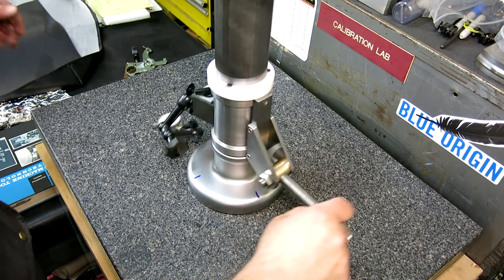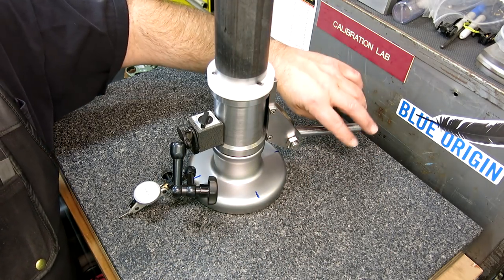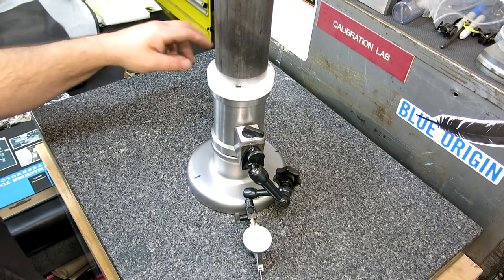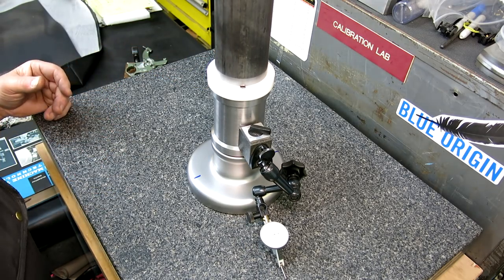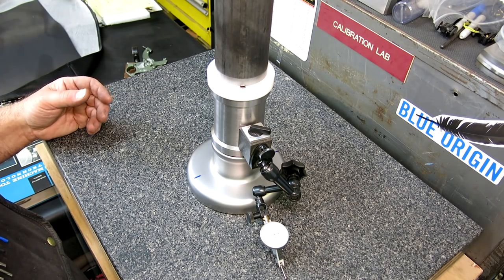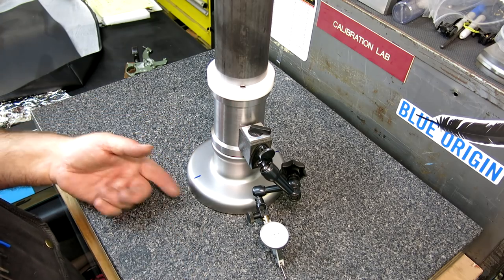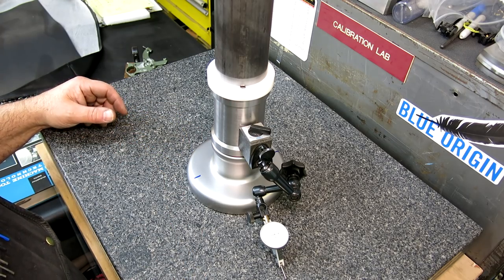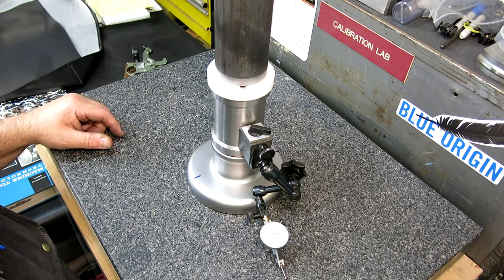1 1/4 thou. And half. Okay, so this is actually kind of good news to me. Means there's not going to be a ton of lapping. So I do want to grind it though, because I spent some time making a fancy grinding setup so that we can dust those feet off. So I'm kind of excited about playing with that. So we're going to go ahead and grind those feet, then we'll lap them and see what we can do here.